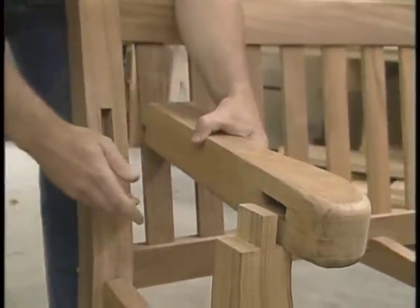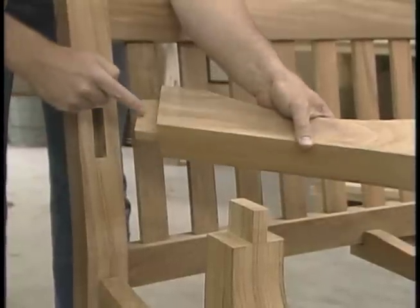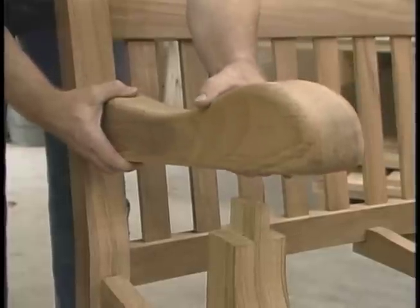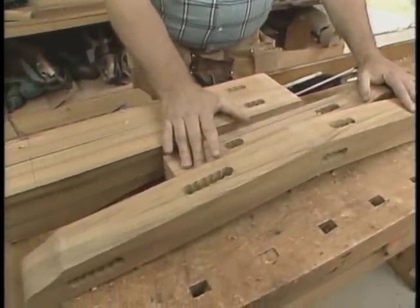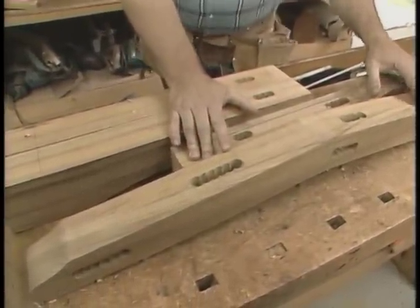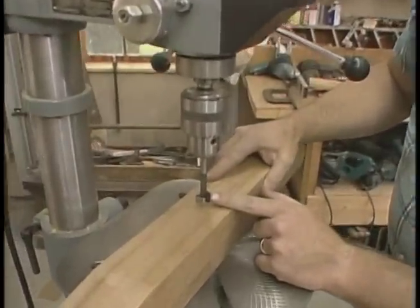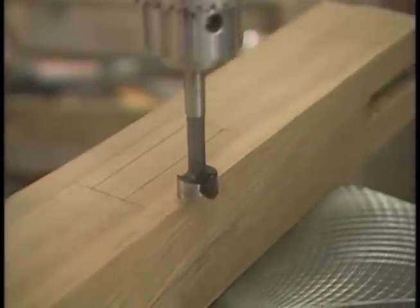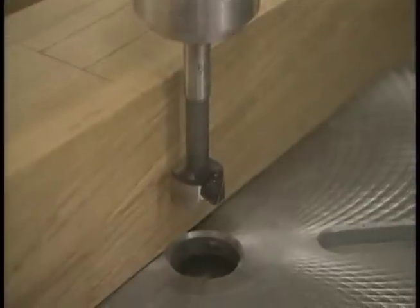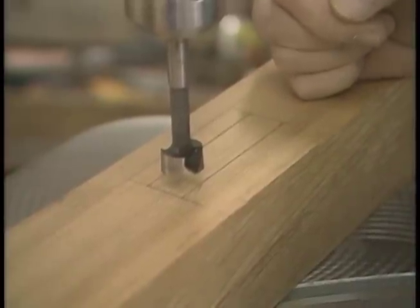All the joinery on the bench is made with mortise and tenons. Here's the tenon, the corresponding mortise — and down here, another mortise with the corresponding tenon. We choose this type of joinery because with a little bit of glue and some dowels, it's extremely strong. What I had to do first was lay out all the mortises very carefully on each piece following the plan and double-checking them before I start to clean them out. To clean them out, I'm using my drill press set up with a three-quarter-inch Forstner bit, which gives me a nice flat bottom. The depth is set on the drill press so it doesn't go all the way through. The idea is to remove as much material as possible with the bit so I'll have less work chiseling it out later.